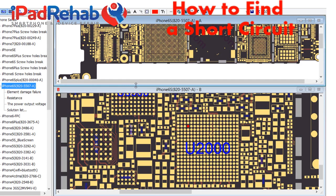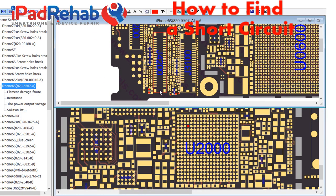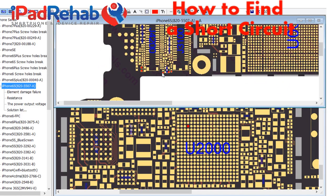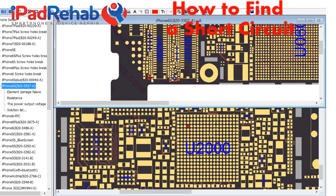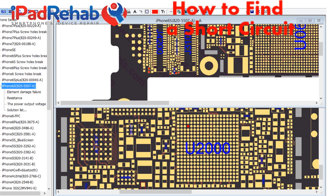Let's see. I see that it has a couple of spots over here. Now, this area did not get hot. Remember, we saw heat over here, but not so much on this side. All right, so PP1V8 goes to a cap here on the edge, a filter, another little cap into the connector. It goes to a resistor, which then takes that line over here to the other side of the connector. And there's a cap here, and then there is this chip. So let's go find this cap and ask if that line is shorted. And there's a couple of other spots as well. So let's go on a hike and see if we can find out if that line is actually shorted or not.